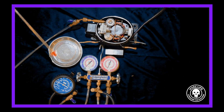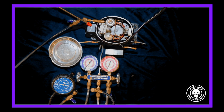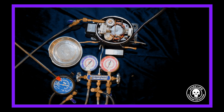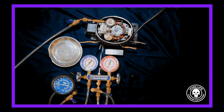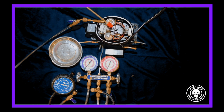The maximum amount of vacuum I've found this thing to pull is about 23 inches, especially when it's on a bigger system. When it's on something like a keg, you're probably only going to get like 10 to 12, but that's all you need — there's just so much CO2 off-gassing. And that's the other purpose it serves: as your keg is under a slight vacuum, it's also removing CO2.